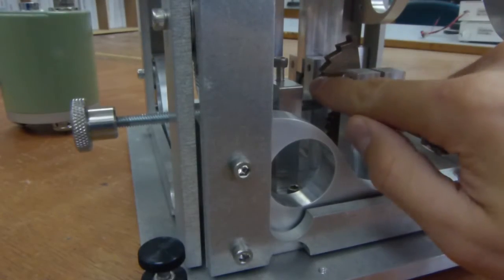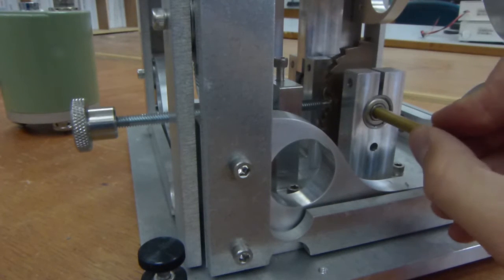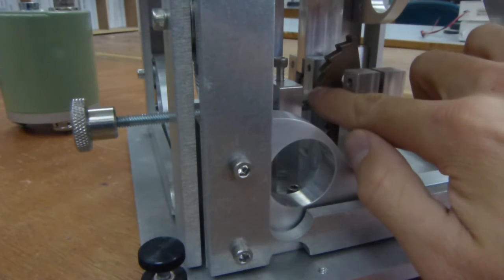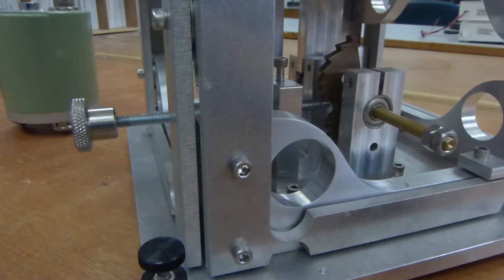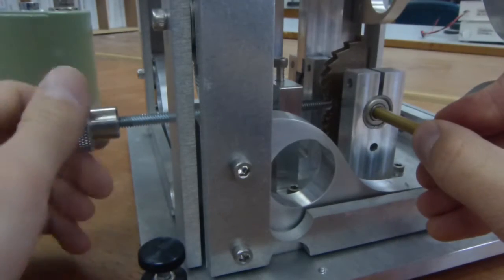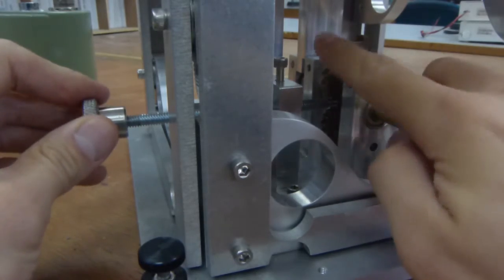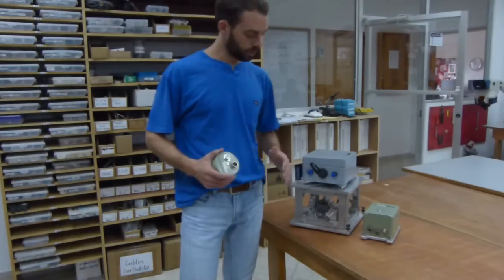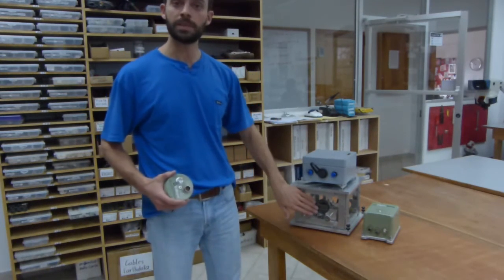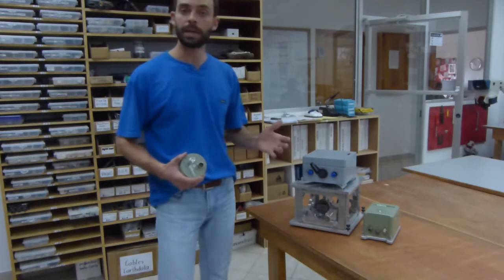The OSOP calibration table has a butterfly that controls the amount of vertical motion seen at the table. The butterfly has a series of steps that allows the end user to choose the amount of motion that he or she wants. We recommend shipping and transporting the calibration table with the butterfly in the lock position. Once you have the table level, your seismometer level, the dial has been zeroed, and you've chosen the position on the butterfly, you're ready to begin calibrating.